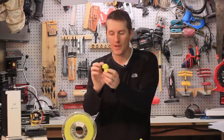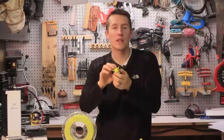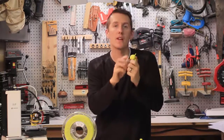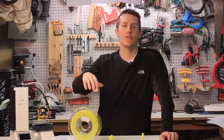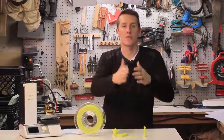With the Yoda figurehead — I used support structures underneath the overhangs, but I don't think it needed them. Even with the small fan, this would have turned out fine without support. With the 0.3mm layer height I didn't think I was going to get a lot of detail, but it looks great in the front and on the top — you can see all the individual details and it turned out really well. Overall, I agree with them when they say this is a next-level filament that blends the best of both worlds between different filament characteristics.